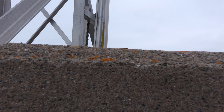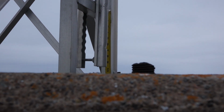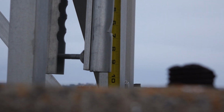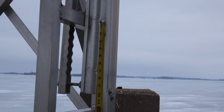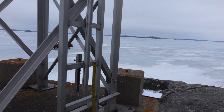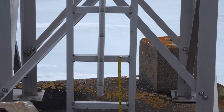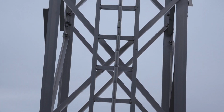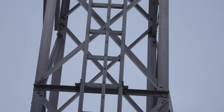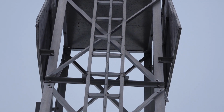Okay, now I'm going to sight the ruler. I'm getting the tops lined up here. And it looks like the tops measure 10.5 inches on the rule. And the rule is measured down from the 15th rung. Here the rungs, top to top, are exactly 1 foot apart. So going from where the rule is there, we'll count them. I've got 1, 2, 3, 4, 5, 6, 7, 8, 9, 10, 11, 12, 13, 14, and the 15th one right there.